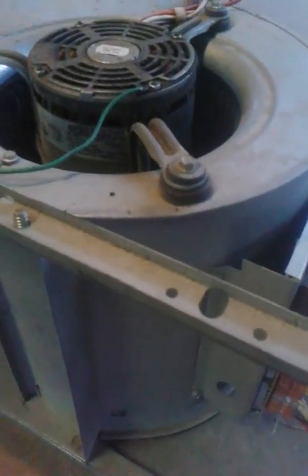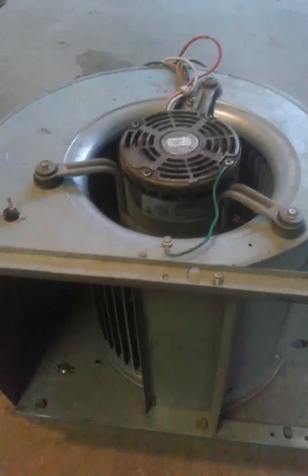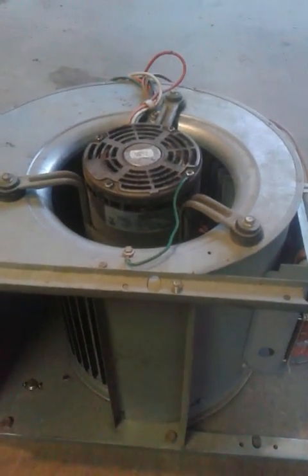These motors are very well-built; they are known to run for a long time and give very few problems, so more than likely for the life of this fan you'll never have to change this one out. Remember, a regular unit — a heat pump or a straight cool — you can't do this because it's 240 volts. But if the unit is a gas furnace like this application was, then you can simply just pull out the blower motor, hook up your little electrical cord, and it will make it run. I hope this cleared everything up. Please like and subscribe to my channel — I hope everybody enjoyed it and there are many more to come. Thank you very much.